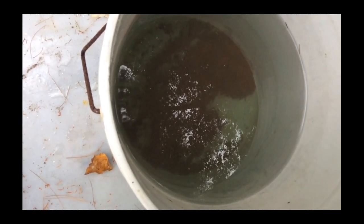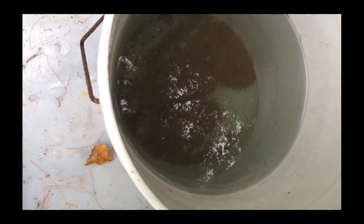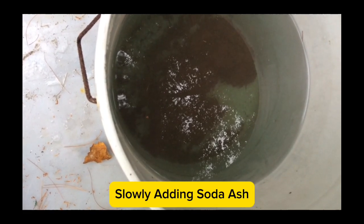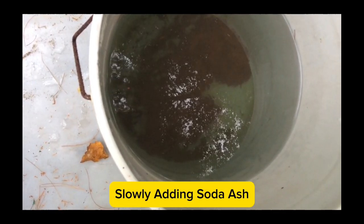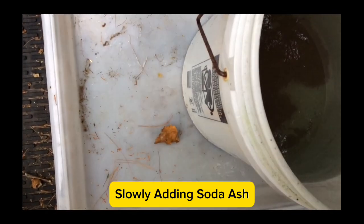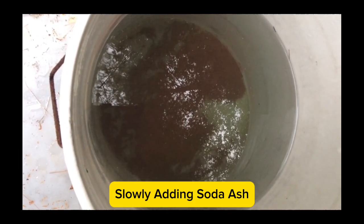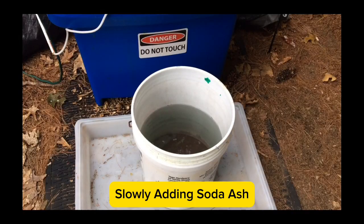This is the dissolved copper from my rinse solution of my acid peroxide. I will now start adding some Pool pH Up little by little to neutralize the pH from 0 to 7. Notice it's only half full and I'm ready for any bubble-up reaction, with a lower pan to catch any overflow. But I'm pretty certain it won't happen because we do everything slowly at Nothing But Gold.